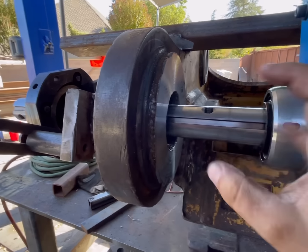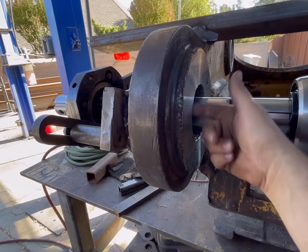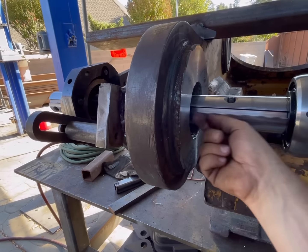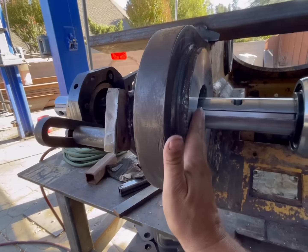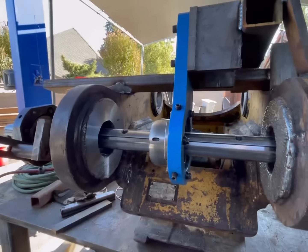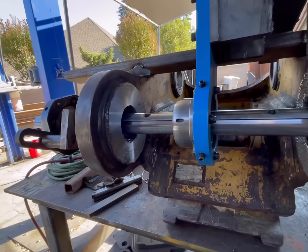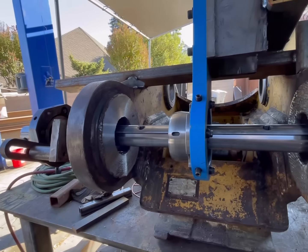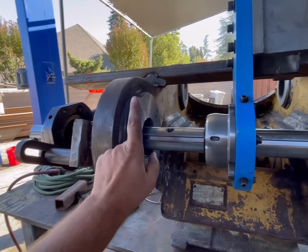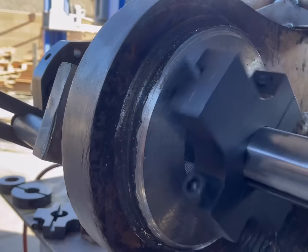So the grease gets pumped into the stick, comes out. It's supposed to hit this. This is supposed to be tight. And then supposed to come up, and there's supposed to be grease in between these faces. That's supposedly how it works. But those O-rings, you know, they get torn off pretty quick. So let's get our tool set up to cut that.